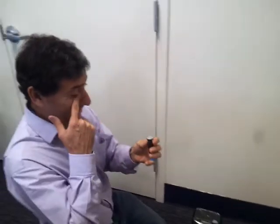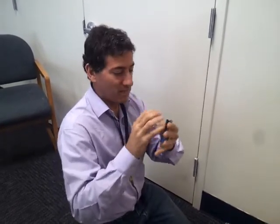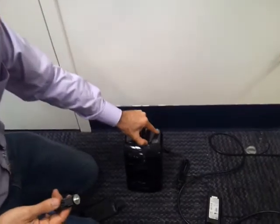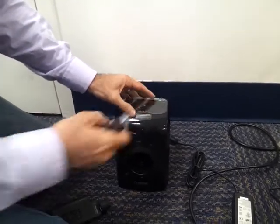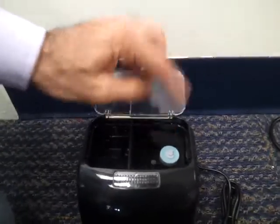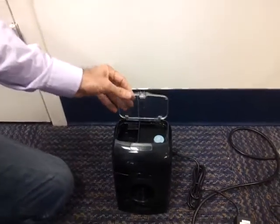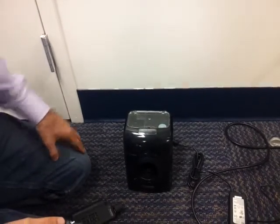So it's not even a hydrogen tank. It's not like it's compressing hydrogen under high pressure in here. It's putting the hydrogen in and it adheres on a molecular level to the metal matrix inside, which makes it fairly safe. And this here is the recharging station. When you have depleted the hydrogen and you're no longer using this, you fill it with distilled water, which goes in this chamber here up to this level, and then slowly dissociates it through electrolysis into hydrogen and oxygen, releasing the oxygen into the air.